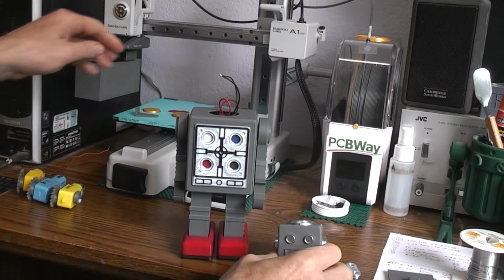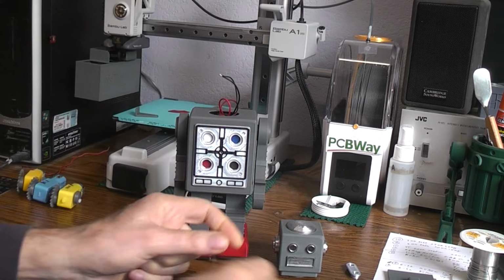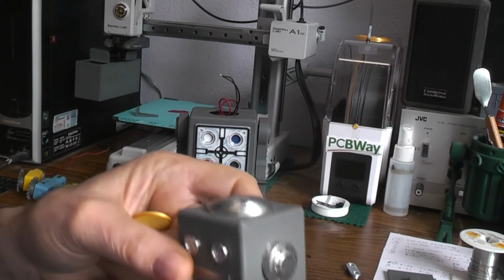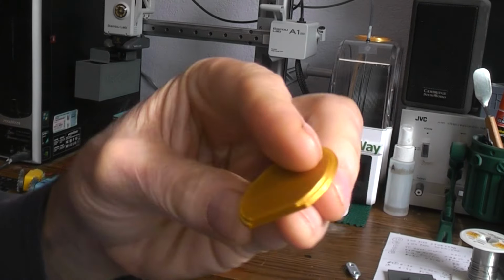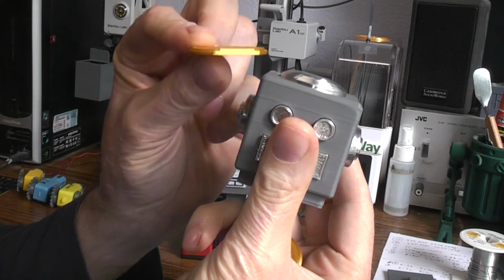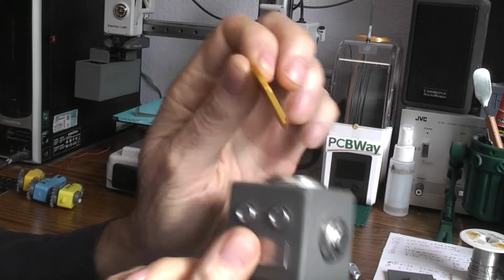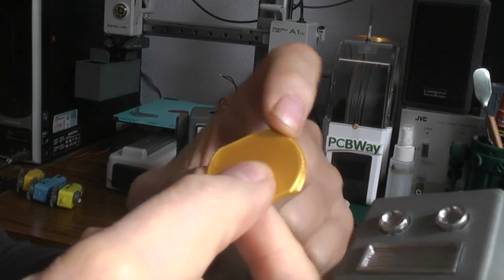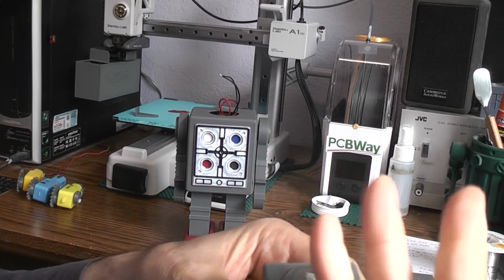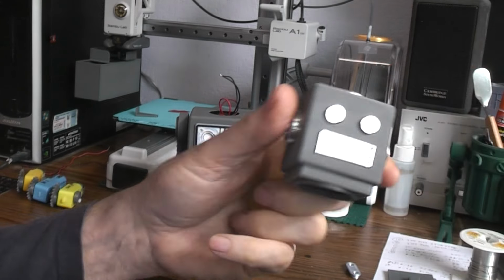The top hat part, though, if you're wondering what's going to hold that down, since it's just a big hole in the top of the head. So here's one of the flatter head tops. There's this piece here with lips that glue in from the inside. I actually insert it from the top and just push it up with my finger, and the glue goes on these little ridges and forms a platform that then this piece can then glue onto.